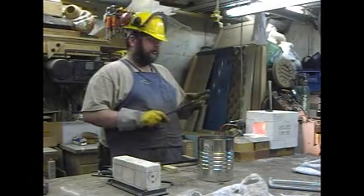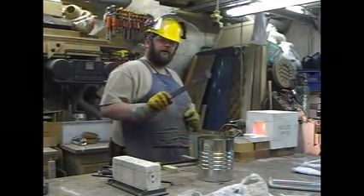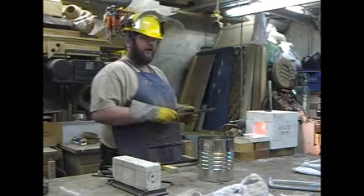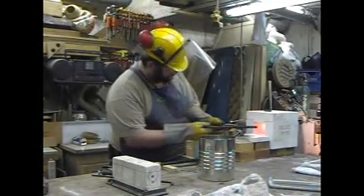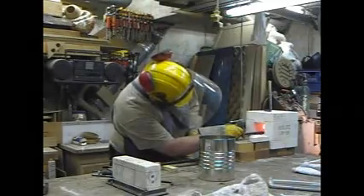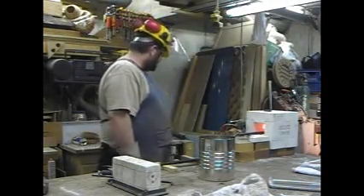This end here is quite hard, and it's also magnetic right now — see, there's my magnet — magnetic. So I'm going to stick that in the forge and we'll come back in five or ten minutes and quench it here in my bucket of safflower oil. Get it in there nice and deep and we'll let that sit there for five minutes or so.